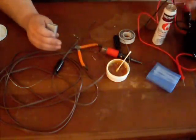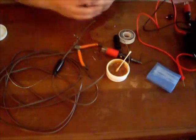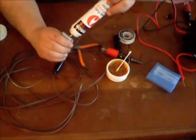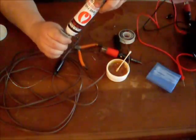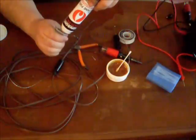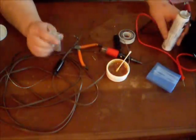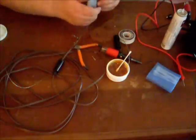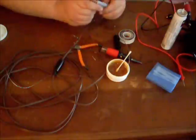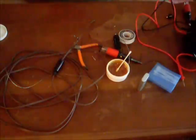Real quick, this is how you refill one of these. Put your cigarette far away, and you just push it down on this little nozzle and wait a little while. On the butane soldering iron you can kind of see the butane going in; on these you can't, but you feel the can gets a little bit lighter. It won't light when you first do this — you have to let it sit for a little while and kind of warm back up because it gets cold. Then you will have a filled-up torch lighter.